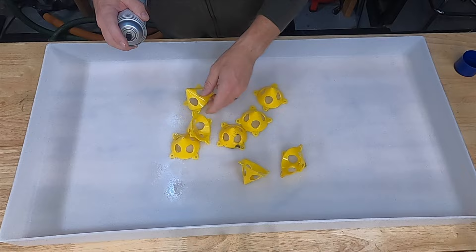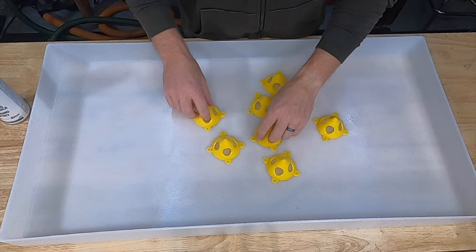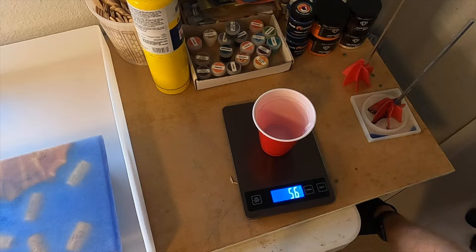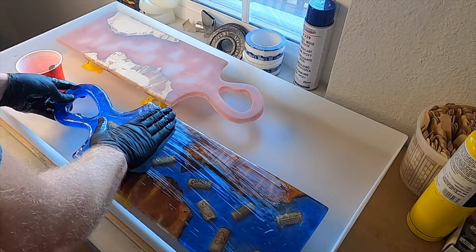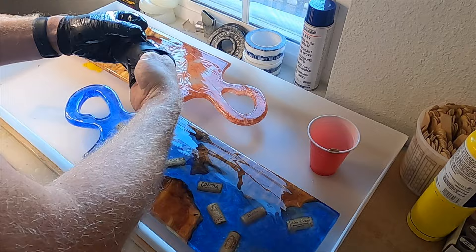I spray it down with this non-silicon based mold release. This mold makes it really nice for doing flood coats on boards — all the epoxy is contained within the mold and it makes clean up really easy. It's time for the first tabletop epoxy pour. I'm mixing up some super clear tabletop epoxy — this is a one-to-one ratio. I'm pouring it on thinly for a seal coat, which is going to seal any cracks, crevices, and any exposed wood. Then I'll go back, sand it down smooth, and get it ready for the flood coat later. By applying a seal coat you limit the amount of bubbles that are going to come through and you also get a nice smooth surface.